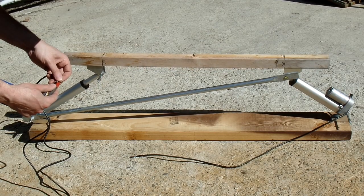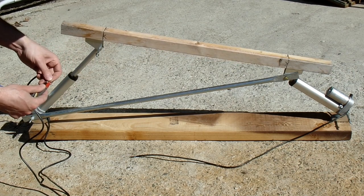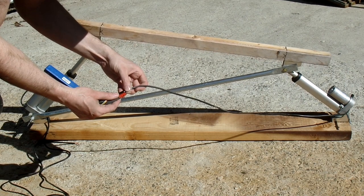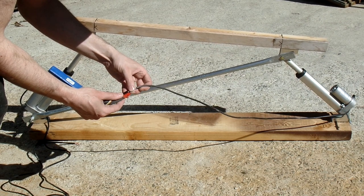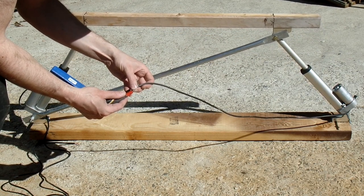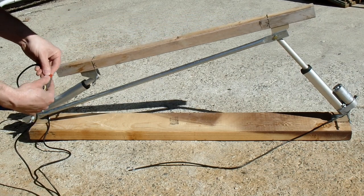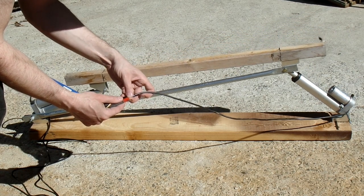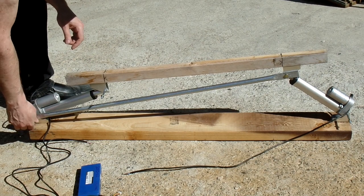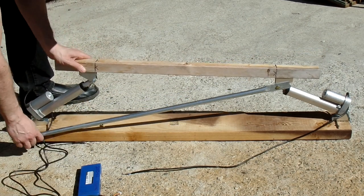Once the diagonal goes on, the device can go up and down. By operating each individual linear actuator I can tilt it, so I have basically two degrees of freedom: up/down and tilting left/right. But it doesn't sway or rock back and forth. You can see essentially a triangle being lifted by the right linear actuator. I don't have control over the side-to-side length — if I really wanted that, I could use a long linear actuator for the diagonal. It's pretty stable with the diagonal in there. If you take the diagonal off, you pivot around the linear actuator and the whole thing is just super floppy.